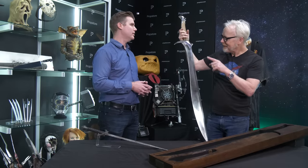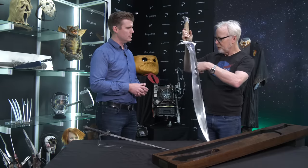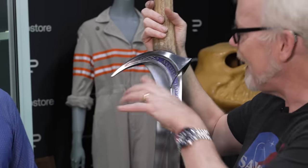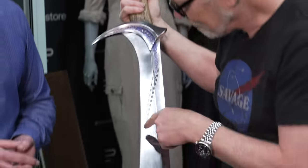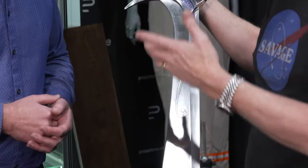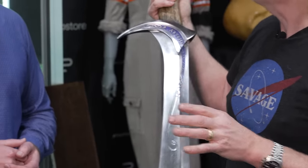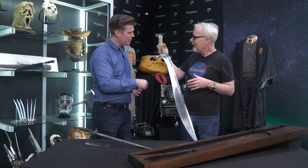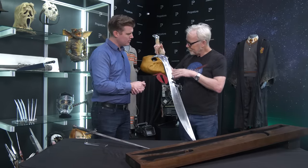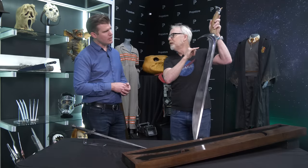In the world of replicas, when you can get something made by the real maker — like having Terry English make a suit of armor for you — it's as good as it gets. To have this hand ground on the bench by the same guy who did all the ones in the movie, you're never going to get anything closer. The other thing I love about Weta's work is that replica swords often use laser etching or industrial processes for the etched patterns, whereas at Weta they're still using resist and ferric chloride and other acids for the etching. There are marvelous little irregularities in there that are super accurate to real armor. This whole panel here would have been etched out, then colorized — it looks like a translucent blue lacquer applied and then partially removed, and you can see the steel underneath.